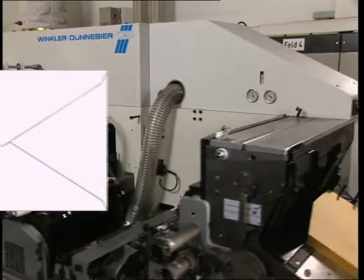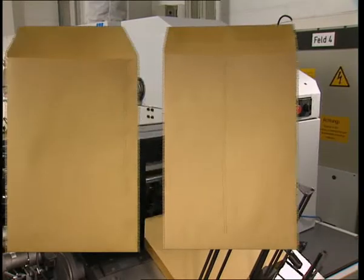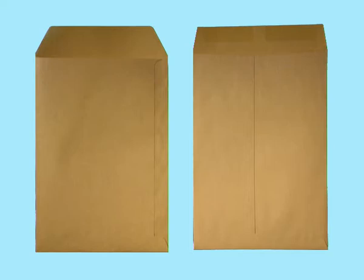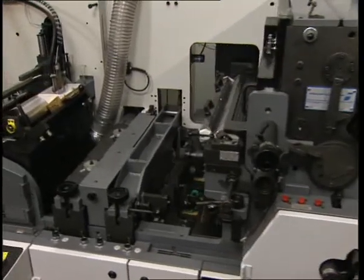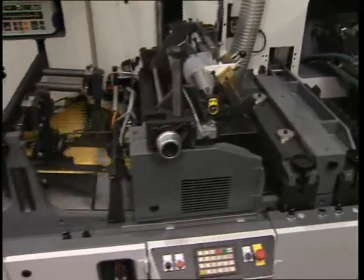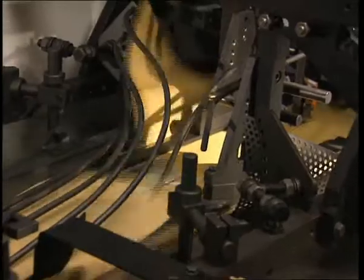As a blank-fed machine, the Classic is capable of manufacturing envelopes in diamond and wallet style, as well as pockets with centre or side seam gumming. The extremely wide variety of sizes ranges from 76 by 90 mm up to C4 on envelopes, and from a minimum 90 by 100 mm up to C4 on pockets. The vacuum belts enable fast changeover and accurate folding of the side flaps, even with large side seam pockets.